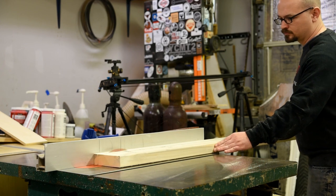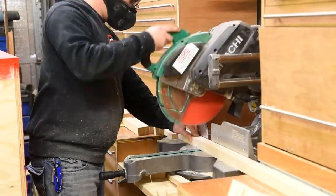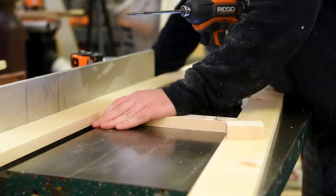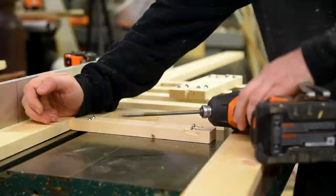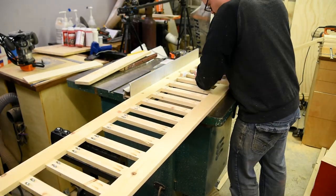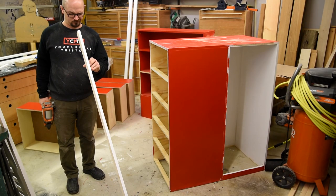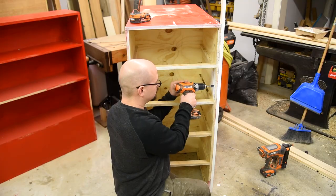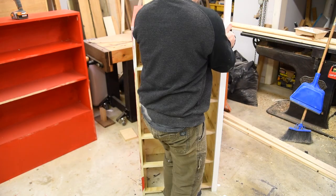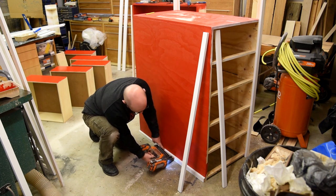The railing and trim were easily the most time-consuming part of this build. I wanted them to have a ladder look to go with the firetruck fire station theme, but also meet the safety requirements for a rail — I'll link below to the Consumer Product Safety Commission's rules for bunk beds. The rails and trim are made from 2x material that I ripped down into 1x material. I made the rail with a lot of pocket holes, but in hindsight, I think doweling them together probably would have been a better choice — not for strength, just so I wouldn't have had to fill all these pocket holes. Some of the trim is what the railing will be partly secured to, so I brad nailed it in place and then followed up with screws for strength.